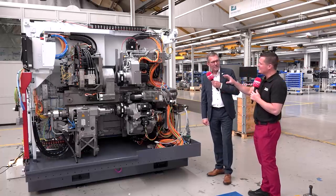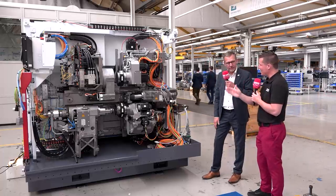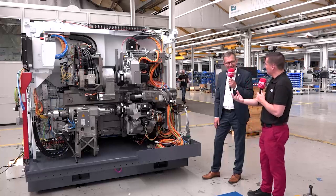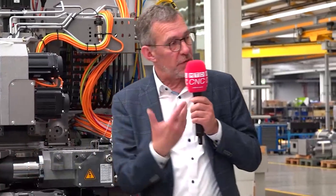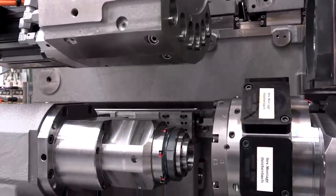Now for the audience, when it comes to sliding heads and fixed heads, there is a budgetary conversation about what can be saved from one to the other, and you can choose which one you want with a quick changeover. It's very simple — we can fix the head to stop it moving, move the head forward if we want to use a fixed head machine, put a collet or chuck on the front, and just run it as a normal fixed head lathe. Or we can remove the collet and chuck — it's about 20 minutes and it's done. Then I can pull the head back, put my guide bushing in the front, and use it like a Swiss-type lathe. It's about a 20-minute changeover. That's all.